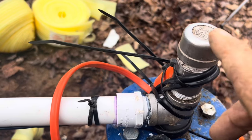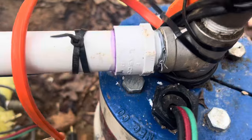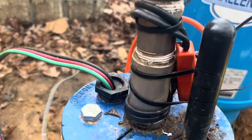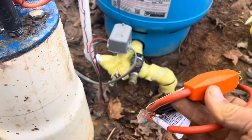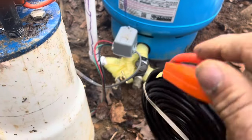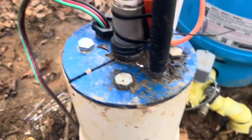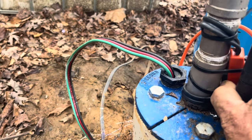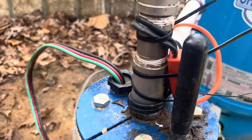We brought it up here, figuring this stainless steel end at the top will probably be the coldest. We put the little sensor — this cord here — that little sensor is what tells it to turn on. We put that on a piece of metal, figuring that'll get cold faster, and zip-tied it tight up against the metal. So when it gets down to about 40 degrees, this heat tape will come on.